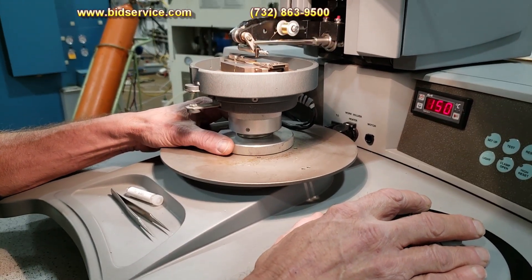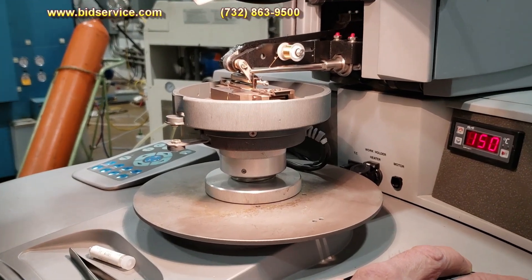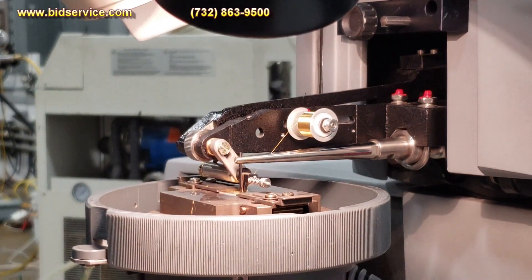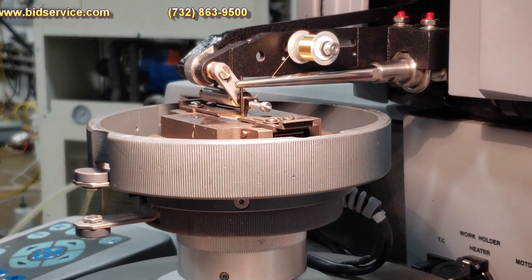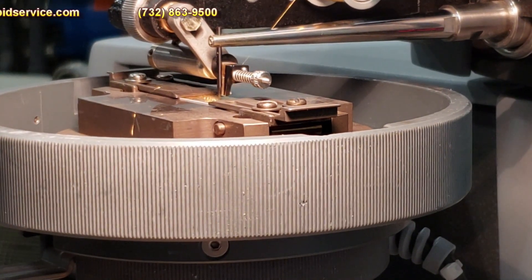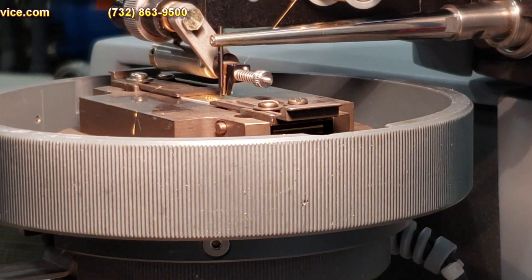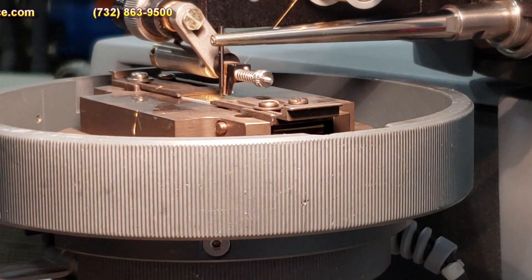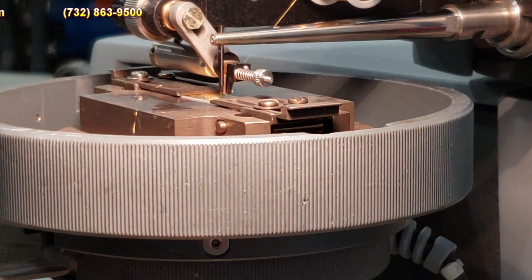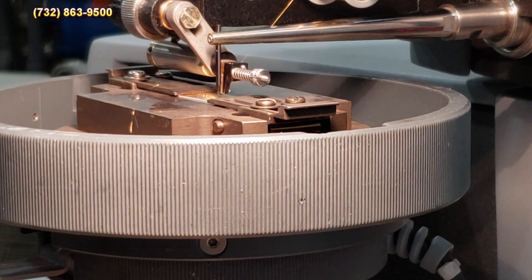It'll cycle through. What you're going to do is press and hold after you're lined up. That'll set you at your search height, which is just above the surface. When you release it, it'll go down and make the first bond. It automatically steps back to the position programmed in your step — this has a motor that drives in forward and reverse. That's your auto step back feature. And then it's at loop height, just above the second position.